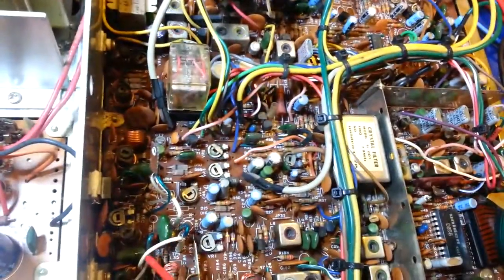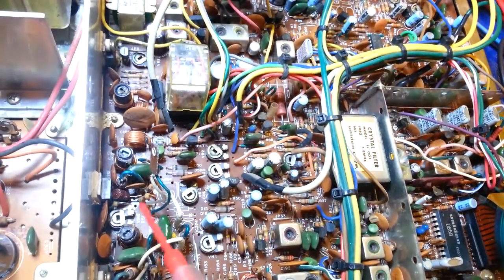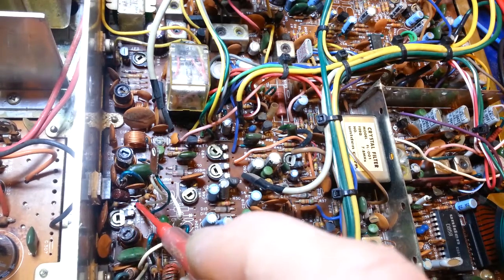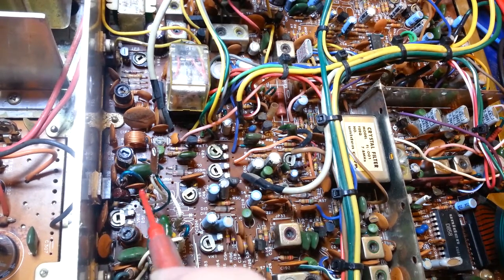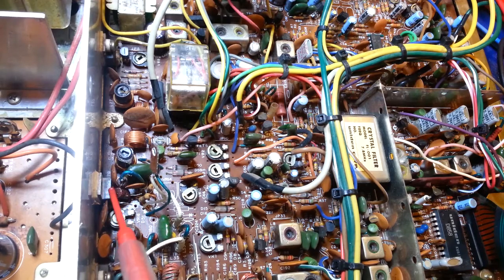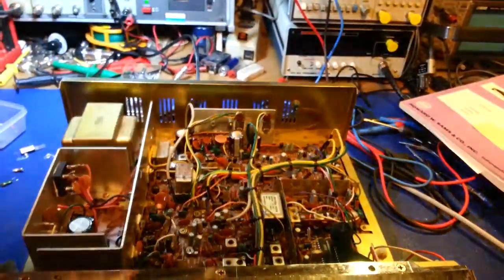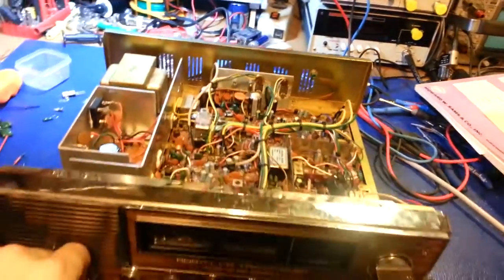I also have, you can see the leg of our 170, I think it was 179, without pulling the schematic back out, right there, that's pulled out of the hole. Here's coil L44. So the bias circuit is completely disconnected from this transistor. And what happens? Let's get that light out of the way. Turn the radio on.